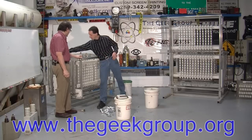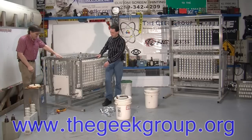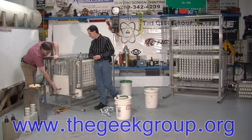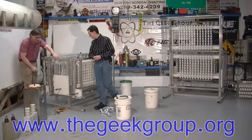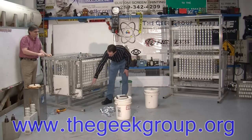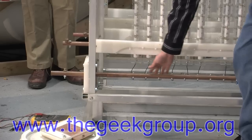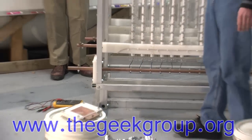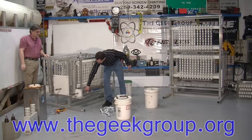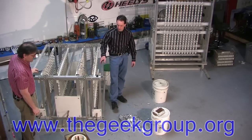And you show them the connections. That's the ground connection in the middle, and then you use the ground on the outside. Basically, this is one end, and the two at either end is the other end of the capacitor strings. There's wires that come up here. You can see they come in on the rail. And these are the little jumper wires, and we can add or remove these to bring strings in. Then they jumper across at the top, and then they jumper from the string, just like they do here, down to the center bar. Yes. And so that's the basics of those.